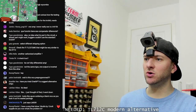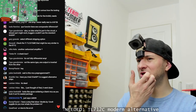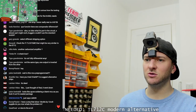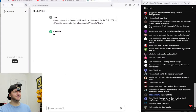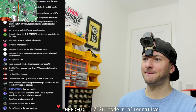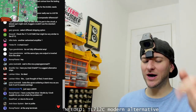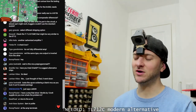Ronnie says, I have an amp that shows 18 volts by 12 volt supply. Do you know what the problem is? I don't understand your question, I'm afraid, buddy. Can you rephrase it? What do you mean by it shows 18 volts by 12 volt supply? It's broken. I've broken it. It doesn't know. At the amp terminals. Which terminals? Power supply terminals or output terminals? Like, you can't have 18 volts at the power supply terminals with 12 volts going in. That wouldn't make any sense.